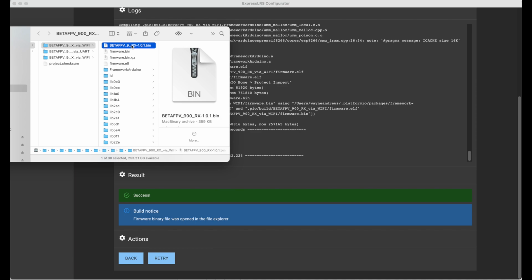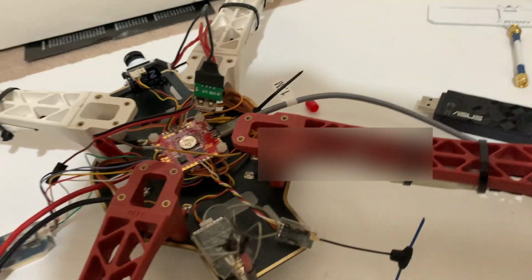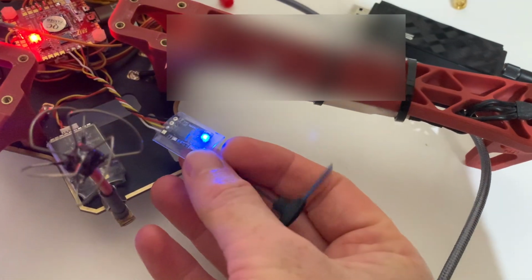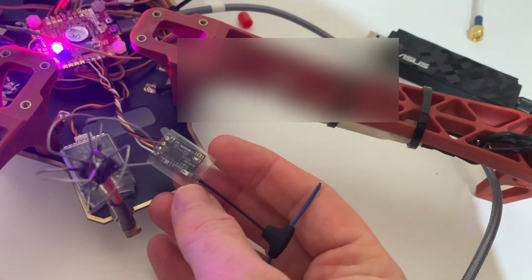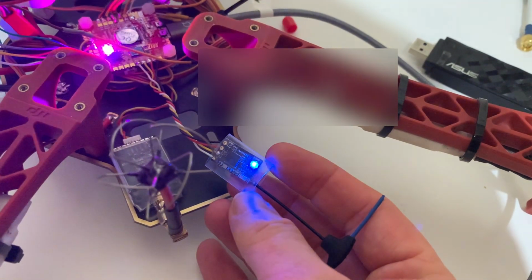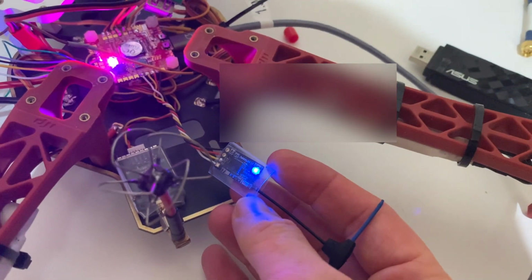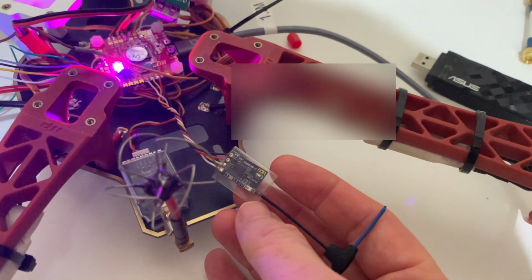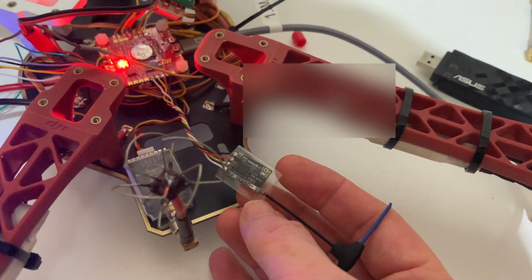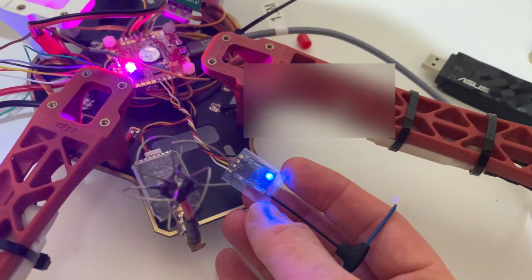Okay, cool. So we've got a build there for the RX. Now let's go and turn the quad on. Okay, here's the quad, and rather than plug a big battery in, I'm just going to plug this power bank in via USB because it does power up the receiver. And what we're getting is a slow flash at the moment, and I'm hoping that after about 20 seconds we'll get this real rapid flashing, and that would mean it's gone onto a Wi-Fi mode. And hopefully I've talked for about 20 seconds about it and it's going to do it in a sec. Come on. Oh yeah, look at that. So real rapid flash there. So let's go back to the computer, see if we can get a Wi-Fi network for it, and then we can try and push it over.